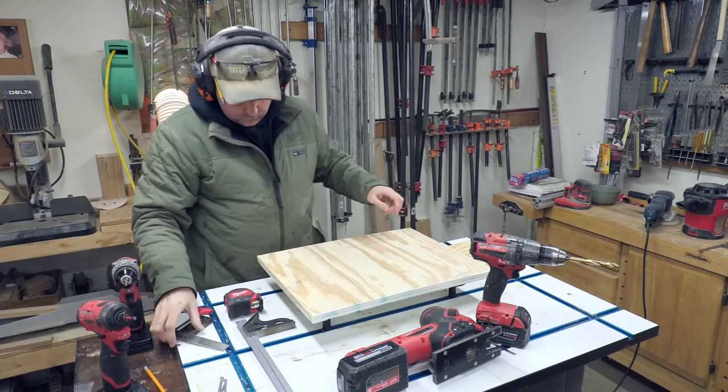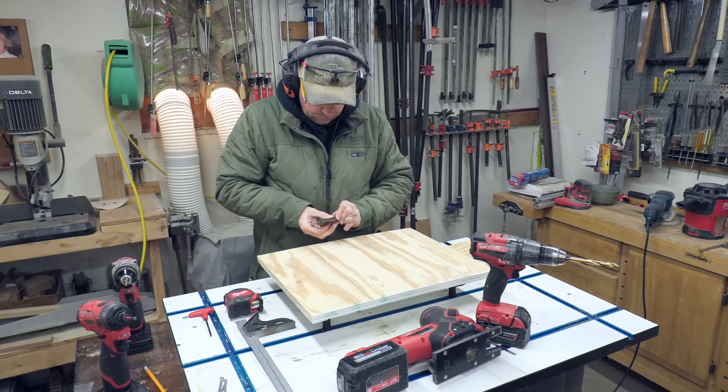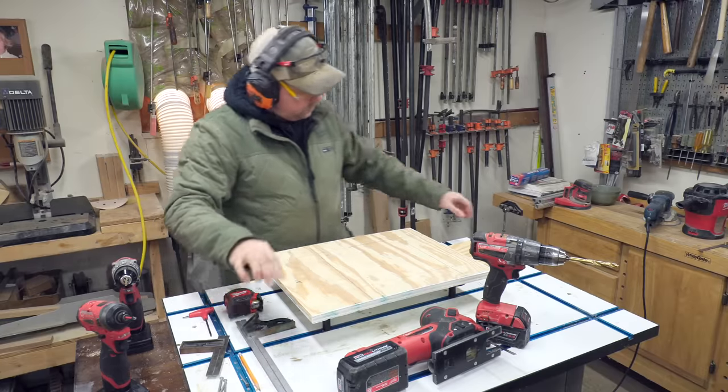In order to cut the larger hatches with an accurate bevel, I took the time to make up some templates. These templates were slightly undersized in order to take into account the width of the base plate of my jigsaw.